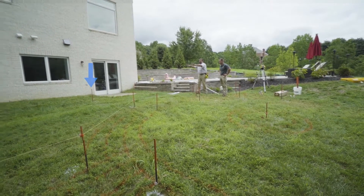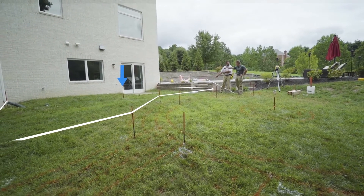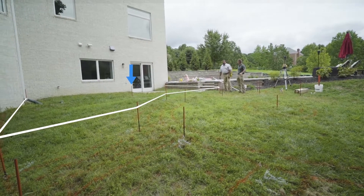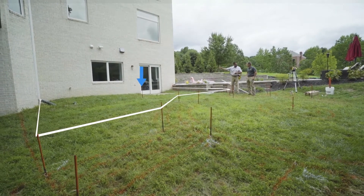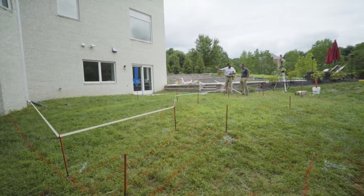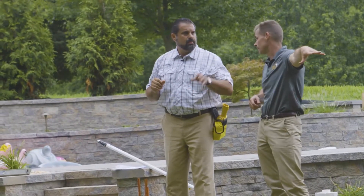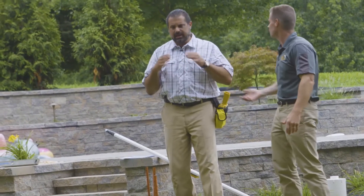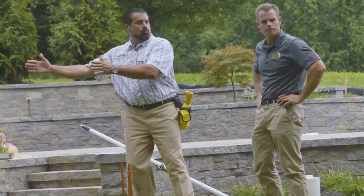We're going to pitch this entire area level on the perimeters, because we have the drain here and we have the threshold of the basement door, and over there we have the steps coming off our new deck and porch. We're going to pitch everything into that drain and run it down with SDR 35 pipe. We're going to transition all tie-ins from a four-inch to a six-inch before it goes out to a gabion basket — a class B rip-rap area to prevent erosion. So that ties into the drain so we don't have any water sheeting over these steps.